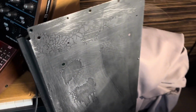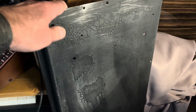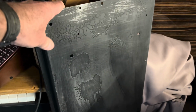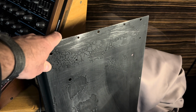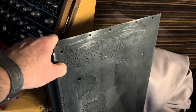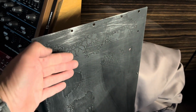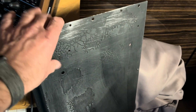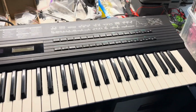To be honest and completely open, I haven't put the base on yet because I had a bit of a disaster with the paint work. I did one coat of spray paint, then the can was pretty empty, so I got another can. I think it was acrylic. They're both acrylic paints, but I think the solvent or the makeup was a bit different because the second coat actually loosened the first coat and it puckered up and did that. So I need to revisit that again. But like I said, for the sake of publishing and getting it out there, I think I'm going to call this done.